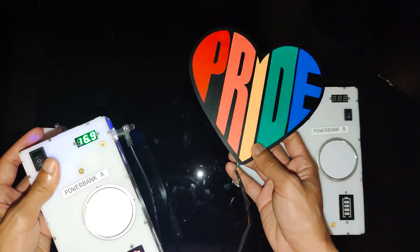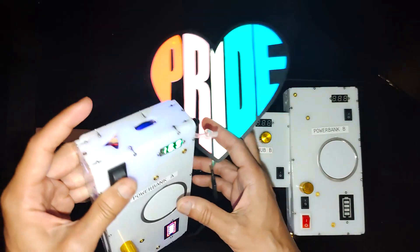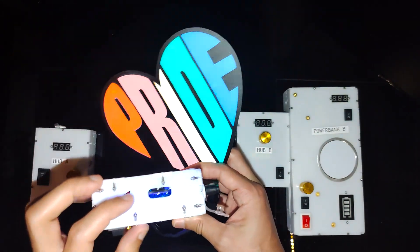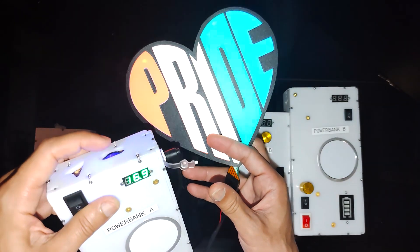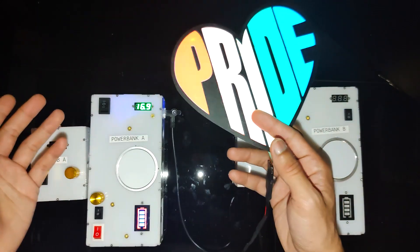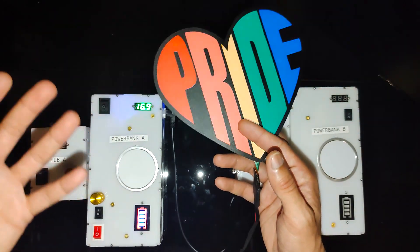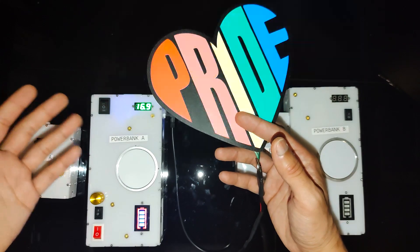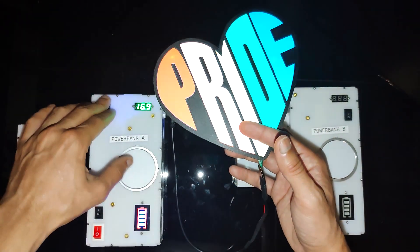All of the various devices you can use to power your sticker light have a sound-activated mode, and in order to better control that mode, they each have an adjustable sensitivity dial. Here it's on top, and depending on which direction you slide it, it affects how sensitive it is to sound. If you find the noise coming out of the driver to be annoying, it's probably a good idea to leave it in the sound-activated mode, because it's less noticeable since it only lights up in response to other noises, which kind of masks that sometimes audible sound.